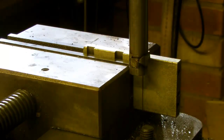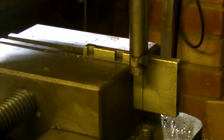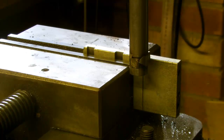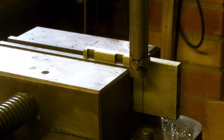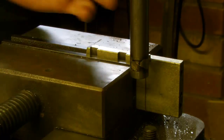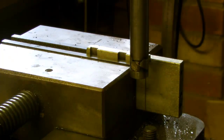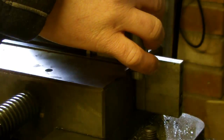There you go - there's a jam. You don't want that. No, that's not going to move. I think what's going to be in order is if I mount it the other way around, because I don't think it's ever going to work like that. The tool needs to go down a bit. I don't think I'll have much success that way at all. Otherwise, what is the point in having a clapper box? Very peculiar. It certainly cuts slots usually the other way.